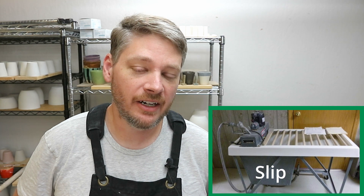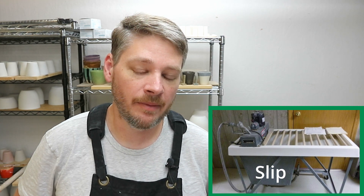If you've been following my channel, you know that I make all of my pots using slip casting. I'm not a production potter and I only make a handful of pots at a time. People that make a lot of pots use a slip table. It has an area in the bottom to hold the liquid slip and a mixer, a pump to pump out the slip, and a hose that lets you fill up the plaster molds.